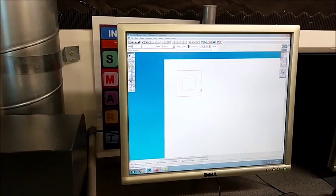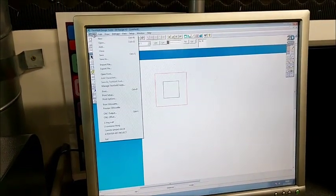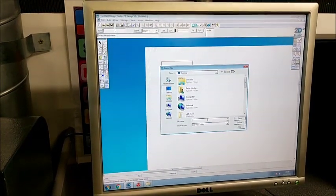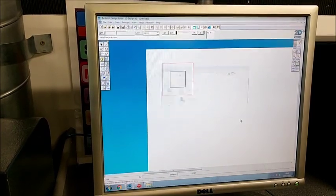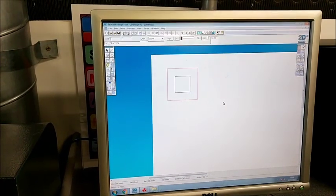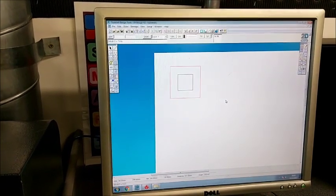So I've drawn my shape, and what I'm going to do is export this as a DXF. So I'll just go to File at the top of the TechSoft menu and choose Export File, and I'm just going to call it File 1. Okay, I'm putting it on the desktop so that I know where it is. If you're saving your work, it's useful to put it into your areas, somewhere into a DT folder or something like this, so you can remember where it is